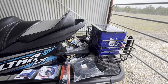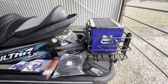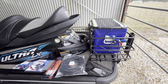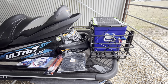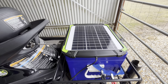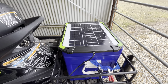So this is the setup I'm planning to do. The purpose is obviously to charge the battery while your jet ski or boat is sitting idle. If you've got a power point, you don't need to go through all of this — you can just connect a normal 12 volt battery charger to the 240 volt mains. But where I am in my shed, I don't have a power point close by, so I've bought this little solar panel made by Powertran. It's a 15 watt, 12 volt panel that generates around 0.84 amperes of current — a trickle charger for your battery while your ski is sitting idle.